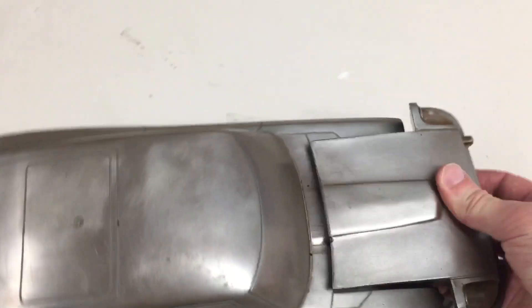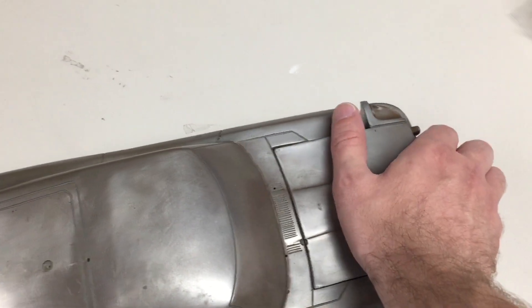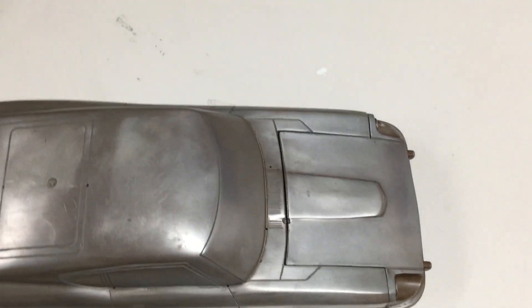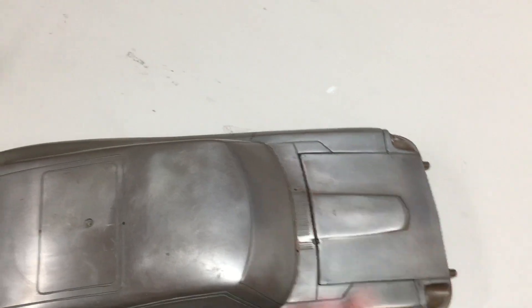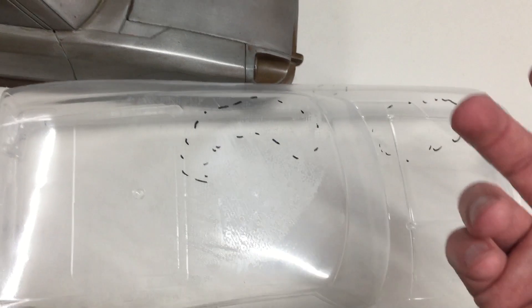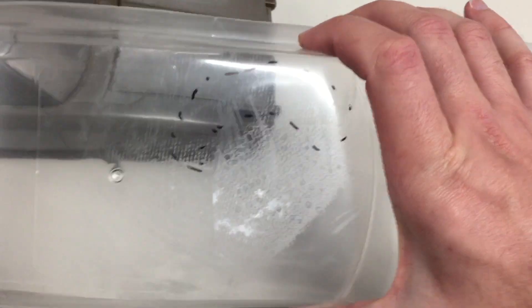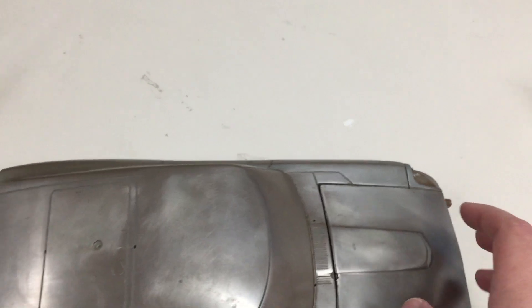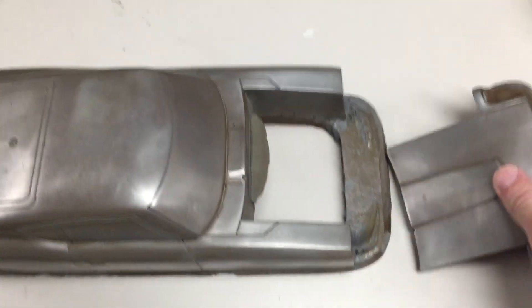What has to be done is we were taking it off the machine, setting the body over on this table, and pulling off — trying to pull off the body like this — which is still very difficult because of course the mold wants to lift up with you. That's why you see handprints in some of the bodies. This one's got paper — we tried to use a paper towel to keep my glove from sticking to it, but the paper's going to stick to it just as much as my glove. I had to put a hand down here while lifting and that worked.